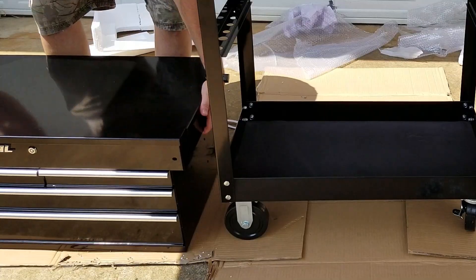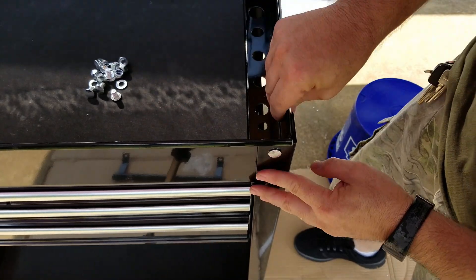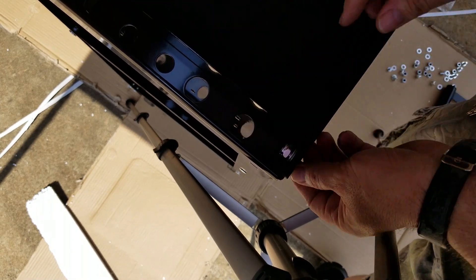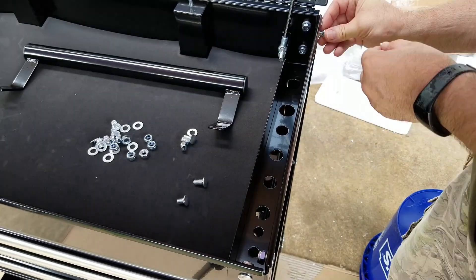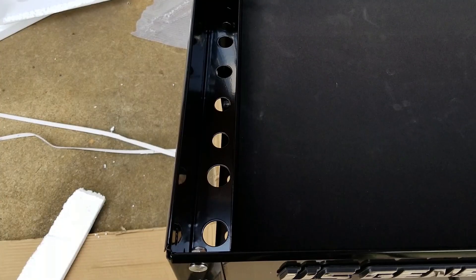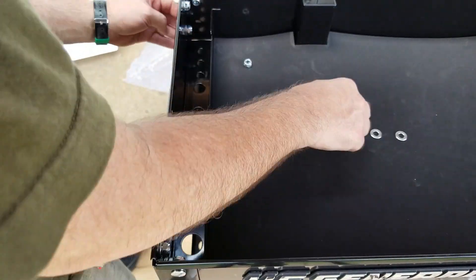Now if you have a little help this will make this part easier. Pick the toolbox up, slide it down in the uprights, and the lip will sit on the top of the uprights — just make sure it is locked on there. Then four bolts will hold each corner of the toolbox portion to the uprights. Here's a better view of the bolts going through, putting on the washer and the lock nuts. On the end with the handle, the bottom set of bolts will be the ones that secure the handle to the toolbox. Run it through your handle, through the toolbox, put your washer and nut on the inside. Do not tighten any of these yet — you'll want to make sure the toolbox is sitting level. Install them all and then tighten them all at one time.